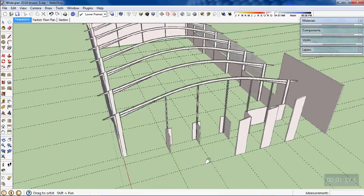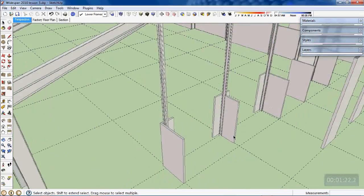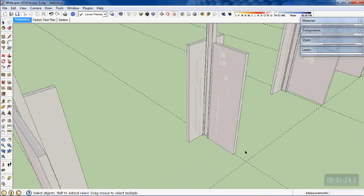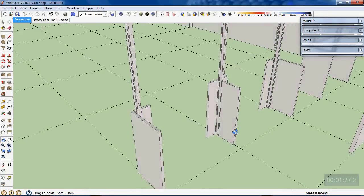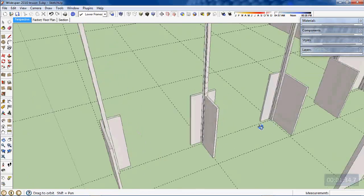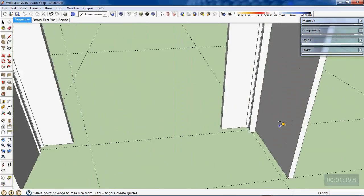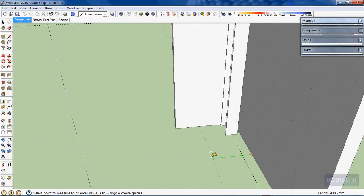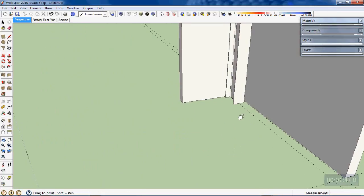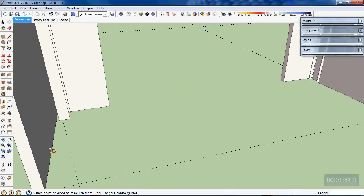Now, the next thing I'm going to do is create this glass curtain wall curved in through here. I've particularly left this wall here back away from the 1500 line for the moment, so that we've got room to work with that glass curtain wall. Once again, I'd always like these walls to be separated by other elements by about 10mm. So I'm just going to grab my tape measure, and I'm going to come off this wall here 10mm. And that's where we'll start this glass curtain wall, along that line, and I'll also go to the other wall back here, 10mm off there.